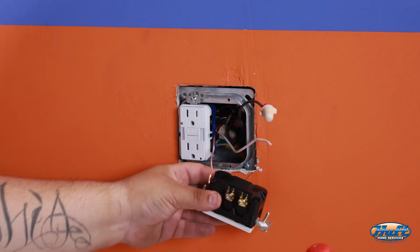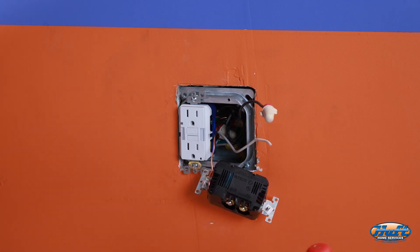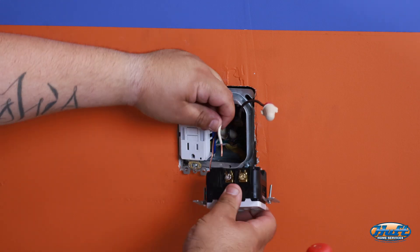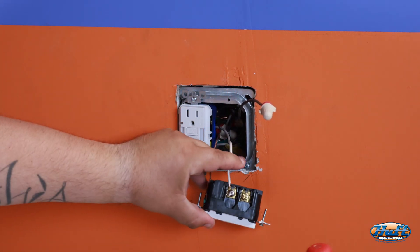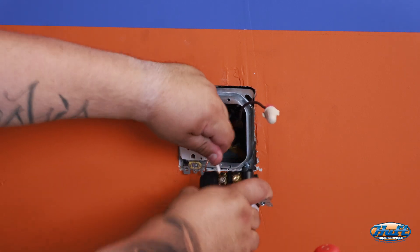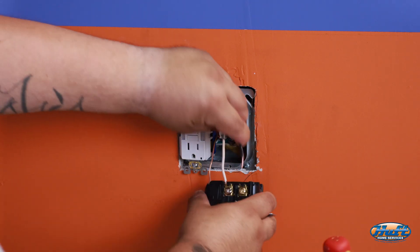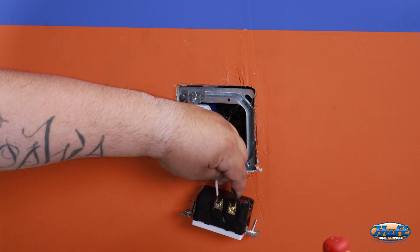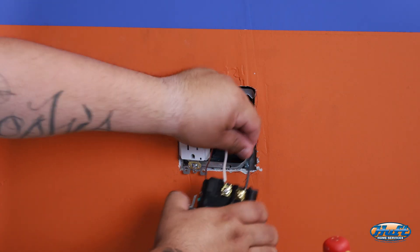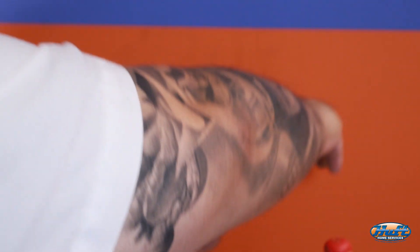This USB outlet is a little different — both screws are on the side and they're labeled: one says 'white wire' and the other indicates the hot wire. Make sure you put your white neutral wire where it's labeled white and the black hot wire where it's labeled hot. Slide the white wire right in, tuck it, then strip and install the black hot wire. Tighten everything down, give it a pull to confirm it's secure, and then wrap electrical tape around the screws to protect them from touching any metal parts.